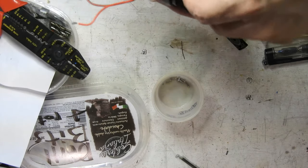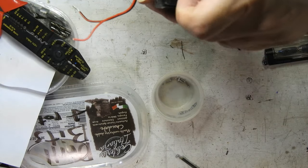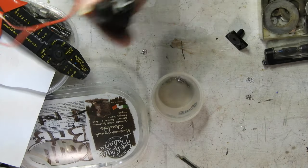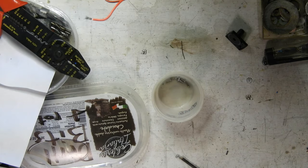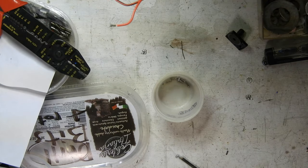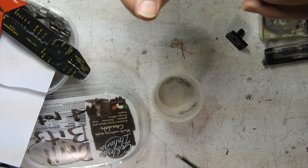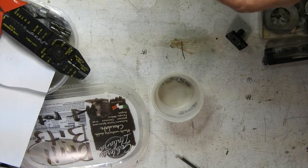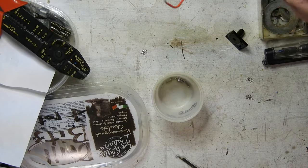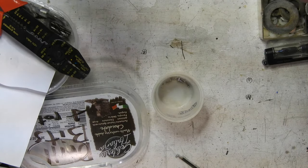This is fully reusable. It was just jammed solid. There was some grit that got inside that little spacing between the piece in there - enough grit to freeze it solid. It wasn't even making noise anymore, so I thought it was totally dead. But no, it was just frozen in there. Once I freed it up, it came back to life - even with the 18 volts. With full power to it, it runs and it stops and runs and stops. But that's fine - it probably wouldn't do that under load. So I can put this back together and have a backup, or use it for some other project.